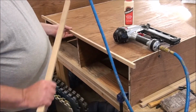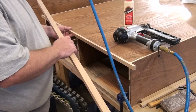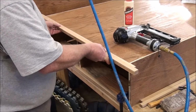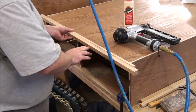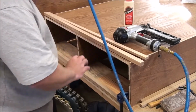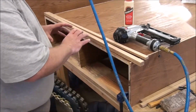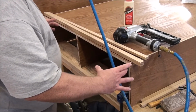this is not big enough, but this is just to illustrate. You take another piece of wood that's large, and preferably hardwood because it's much more rigid. You place that across your workpiece, and you clamp that. And that caul is supposed to then more effectively transfer that clamping pressure along it. A couple of different problems with that is I don't have scads of this hardwood sitting around. This is very expensive stuff. So I don't have a great big beautiful piece of hardwood that I could use for a caul, because a proper caul for this would be 4 or 5 inches thick. Very big piece of wood.